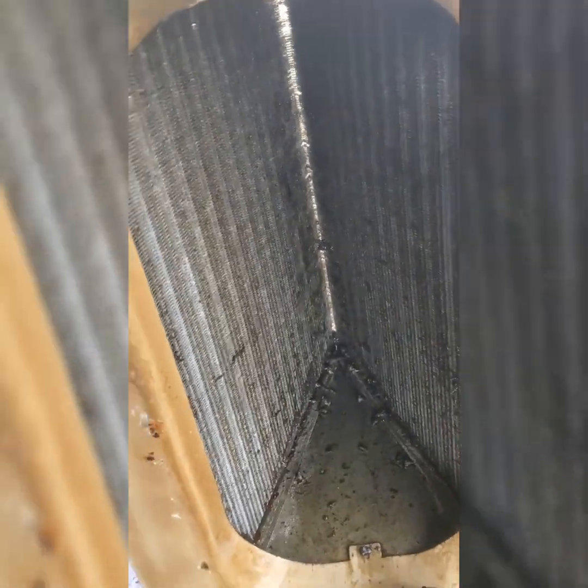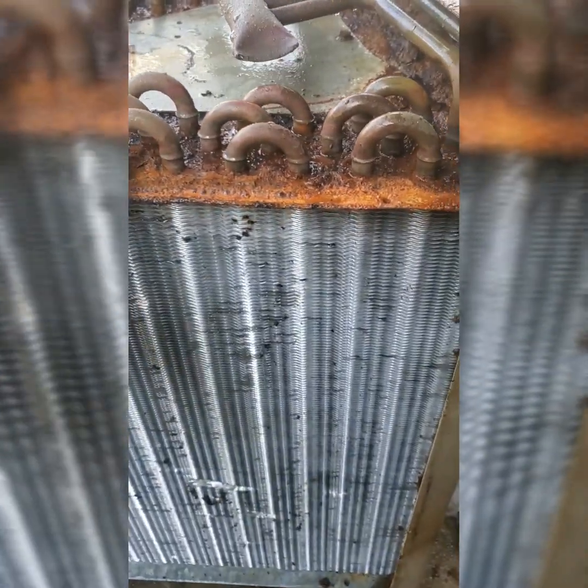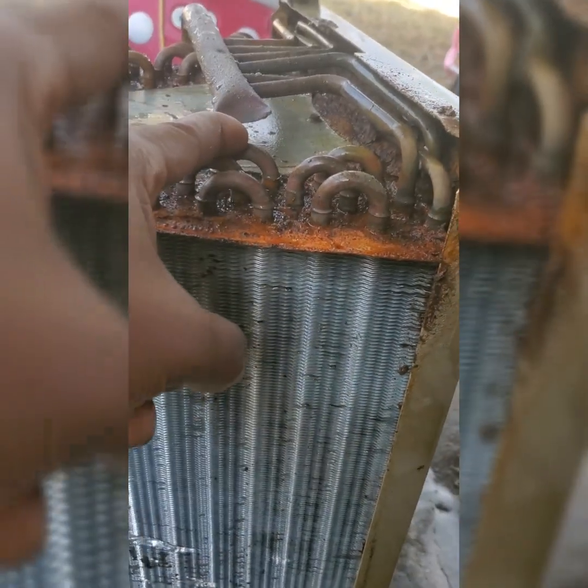Which is great for our coils. The thing is I have to actually hose it down from the inside. The reason why is because again our outside coils look great, but not so much for the inside ones. That's because right behind where the coil comes in there's this copper tube, and behind that between those spaces there's another and then another set back in line with all of these crazy tubes going in between them. It's actually pretty difficult to flush through, whether it's a vertical or horizontal unit — it's difficult to actually clean that monstrosity out of there.